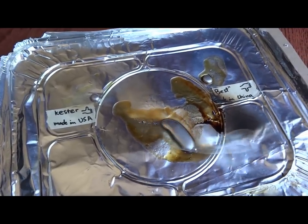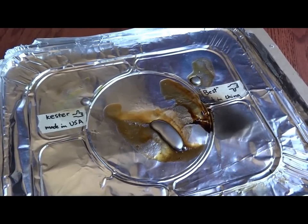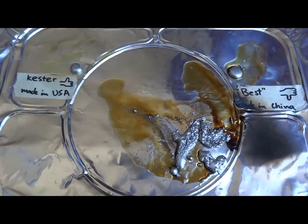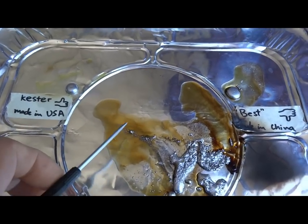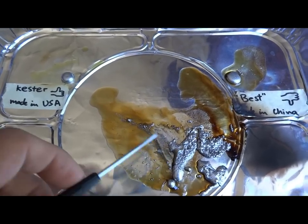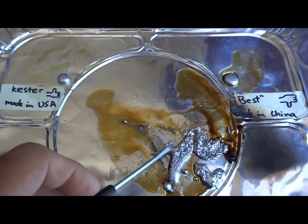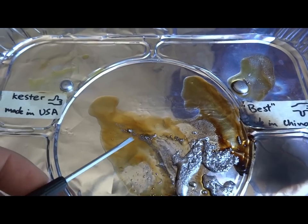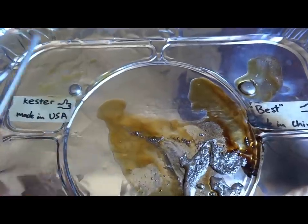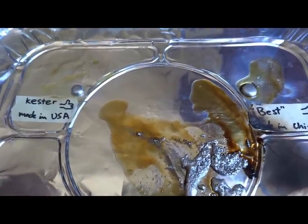So yeah, I hope you enjoyed this, and make sure you read my blog post about solder paste and why you should not buy Chinese branded paste. It's really not worth it. One thing I really wanted to point out was how many little balls of solder get formed when you reflow this paste, but do not actually reflow into the larger chunks of solder. And that's really problematic because they might cause some shorting, or they're just messy, even if they're not actually forming shorts on your boards.